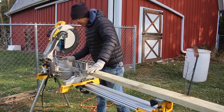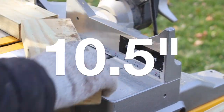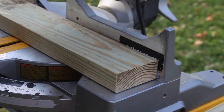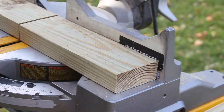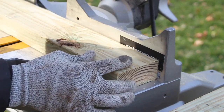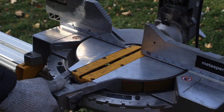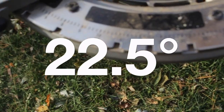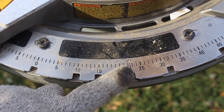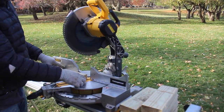Back to cutting the wood. I was chopping a ten-and-a-half-inch section — you're going to need eight of them. There are a couple ways to do it: you can cut them straight up square and then nip the ends off, or you can cut your angle and then flip the board, cut your angle, flip the board. It's kind of up to you. But the angle is pretty crucial — if you're making an octagon you've got to cut a twenty-two-and-a-half-degree angle. If you're using a chop saw or miter saw, it already has the twenty-two-and-a-half nipped out on the settings.